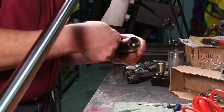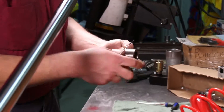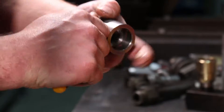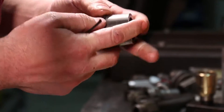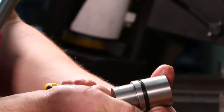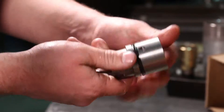Peel it around, get it started, then work it all the way around. One thing that'll happen is that seal will turn inside out on you — which isn't a big deal, you just spin it. Check that it's on right. If there was an o-ring sticking out, pull it off and put it back on again to make sure nothing was damaged.